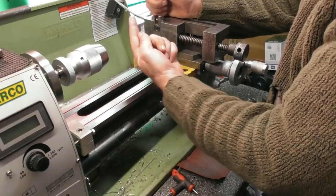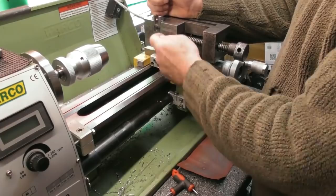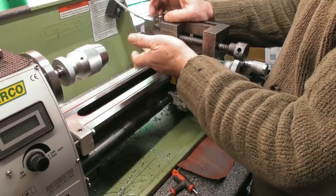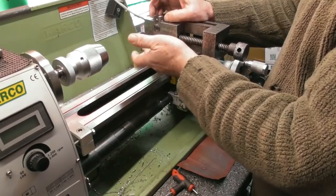However, I've already got 2mm clearance on the 6mm bolt, because it's 6mm and it's a 10mm hole. So I'm halfway there already with a straight 10mm hole. Now I can't open the hole up any more, so what I'm going to do is set half the angle at around 6 degrees and put a milling cutter through from this face at 6 degrees just to elongate the hole in the direction I want it to go.